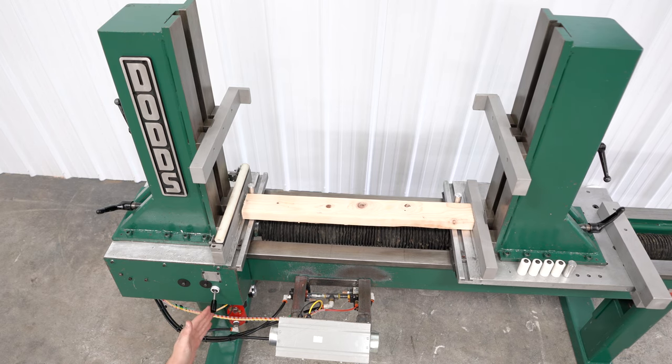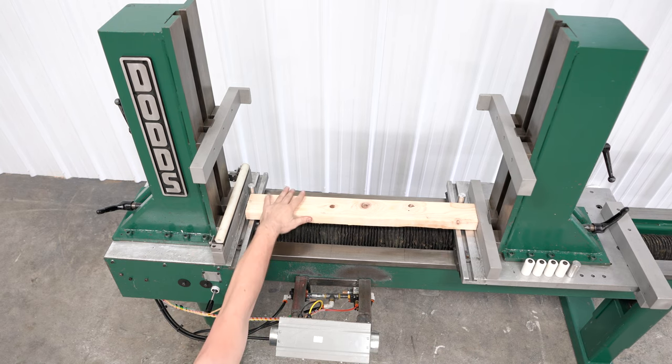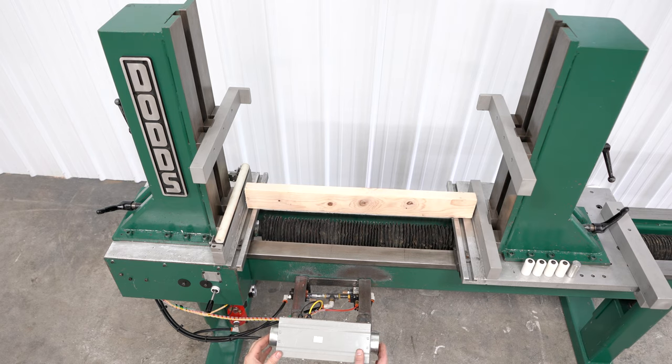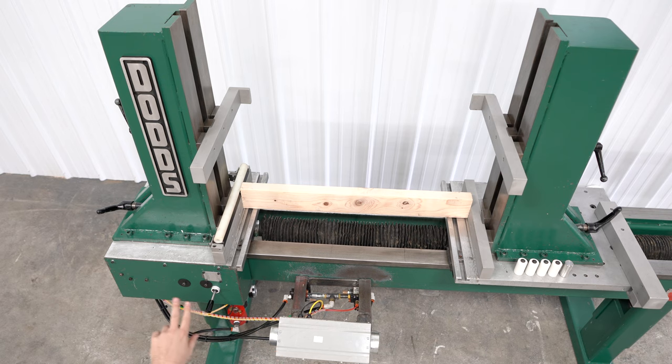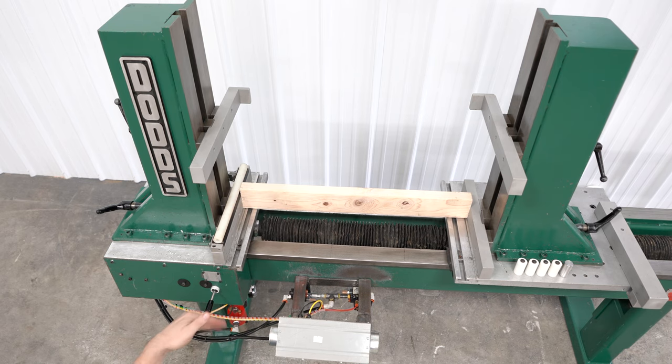So we're going to open it up. Whenever you put a drawer in, you're going to hit this pressure bar. Let's pretend that's a drawer and we close it now — that's going to keep that air motor engaged. That's actually the air coming out of the back of the air motor. You are now literally holding with that air motor. The higher you go up, you'll actually hear the air motor engage if you were to turn it up. Right now we're set at about 40 PSI, so relatively lower — it might even be about 35.